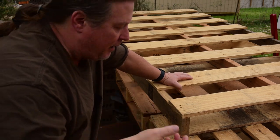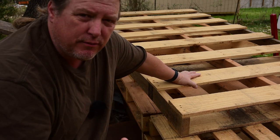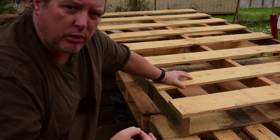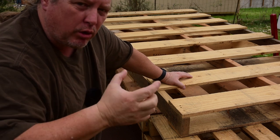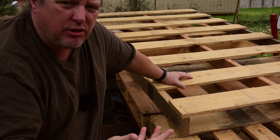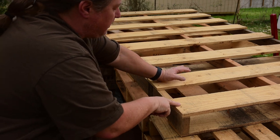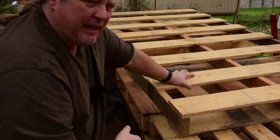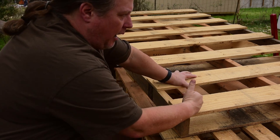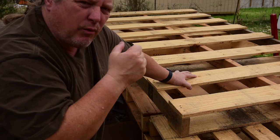The outsides of pallet wood take a huge amount of abuse — they get dragged, get oil smudges from forklifts, all that. Just like when I buy construction lumber, that last inch or two at the top and bottom of the boards needs to be cut off first. You don't want that stuff getting into your project or affecting your paints. Also, because these boards are so green when they put them on pallets, there will always be some cracks. Cut off that little inch and it makes the boards more durable — I don't want to be nailing into established cracks.